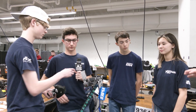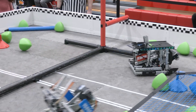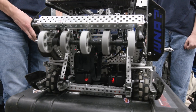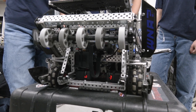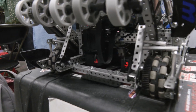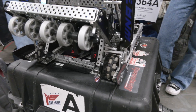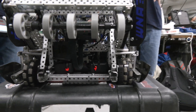Let's talk to Henry about your intake and lift. So I want to first start with our intake. We decided that we wanted to use flex wheels because at Haunted we had a moment where in semifinals we got entangled with our opponent in the middle of the field — it wasn't illegal, but it lost us a ton of time in the match. We learned from that and decided flex wheels was a better design. We also use a distance sensor on the intake to help us not contain too many triballs and keep to that possession limit.